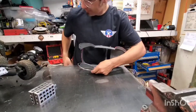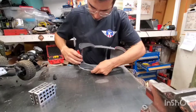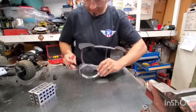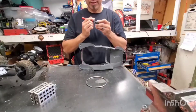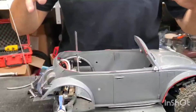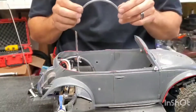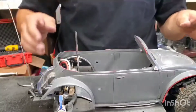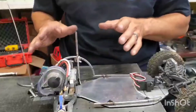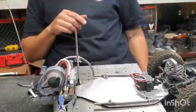Take your Sharpie and mark it where you want your bends to end and begin. I should have enough material to do both arches. I'm going to get these cut out, then get it set up on the frame — set the body on, get everything aligned, and then tack these up. I've got the body set where I want it in relation to centering, and I have our new arch for the rear section set in place using one of the tower fixture tables. Everything's lined up and now I'm just going to tack that into place.